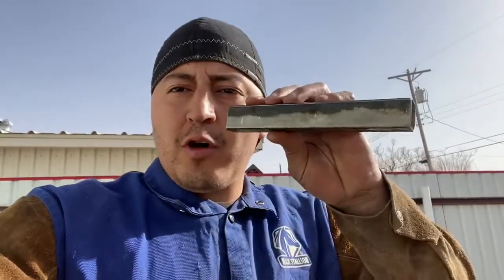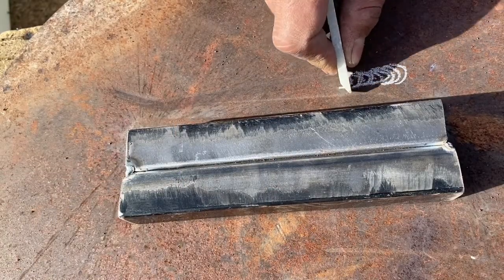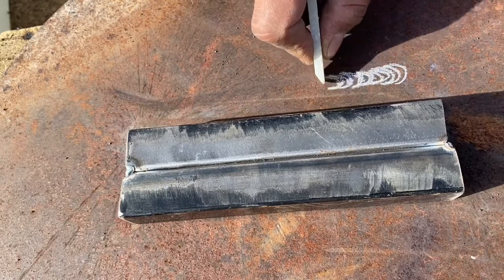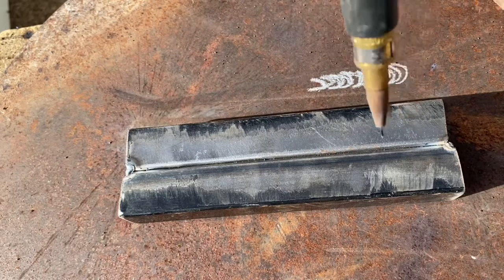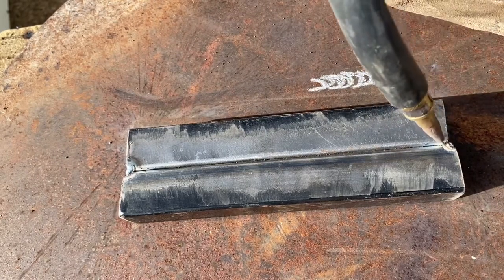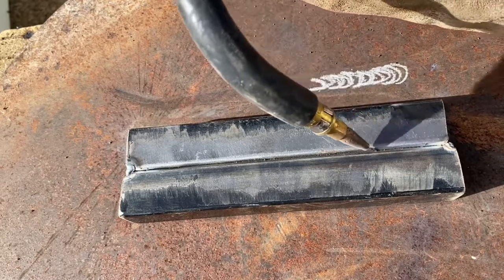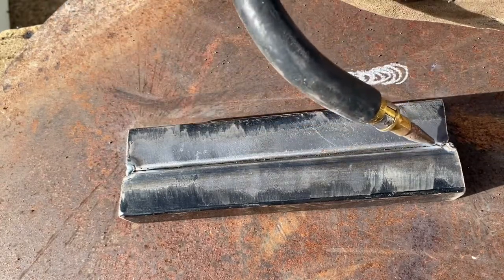Welcome back, Coinzy Welds. Today we're going to be welding thin square tubing for beginners. I'm going to show you a few techniques that have helped me improve my gasless flux core welding. The first and one of my favorites is the little C technique, or some people call it little waves. Keep about a half inch stick out — remember, you don't want it straight perpendicular, you want a little angle. And if it leaves a slag, you have to drag.